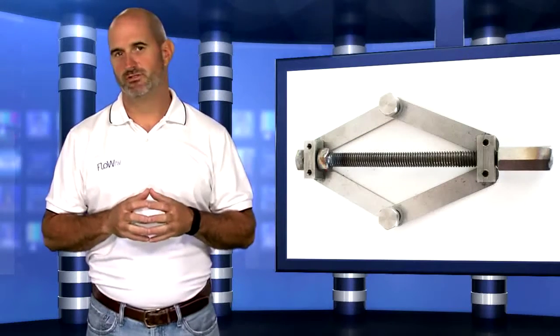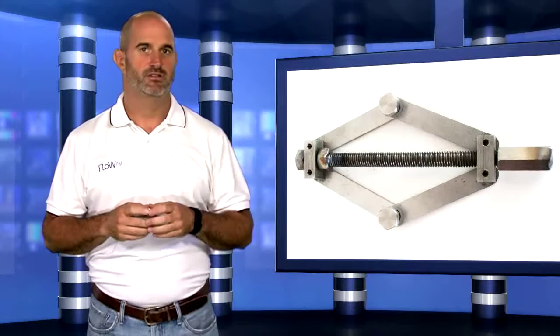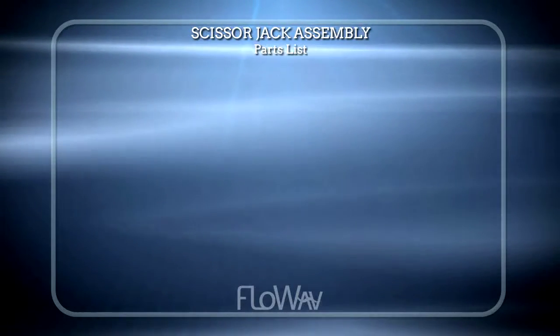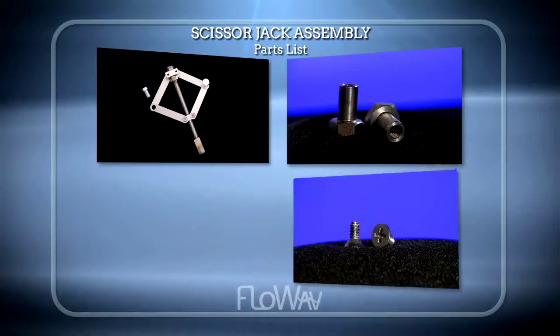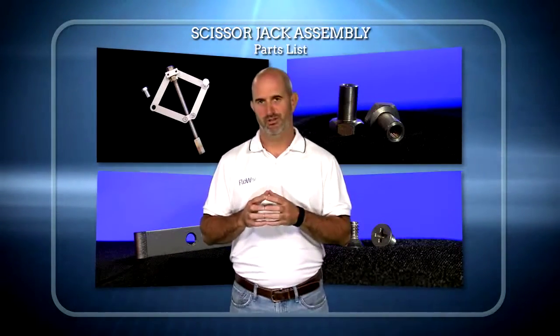When you receive your scissor jack ring, the scissor assembly and the Stingray mount will not be attached. So attaching these items will be the first task at hand. Start by locating all the parts you need. You should have the scissor jack assembly, 2 threaded posts, 2 screws, and the retaining clip. Have you got everything? Good.